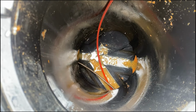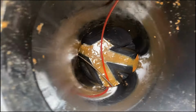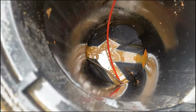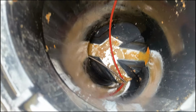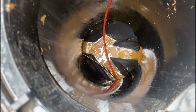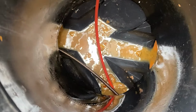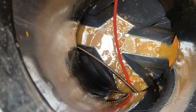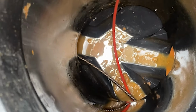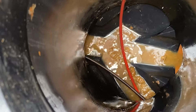I've got a video to show you. Yeah, he's going through here. This is in the drain, up the drain into the soil stack. The toilet is just here with its white pipes. Right, if you can see that. Jamie's got the snake here. He's punched a hole through the blockage, and he's going to bring it back and mash it all up. It's going to flow through.